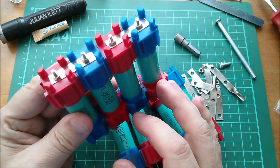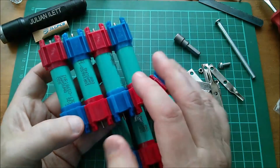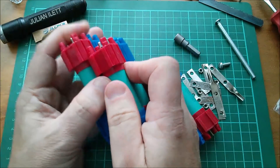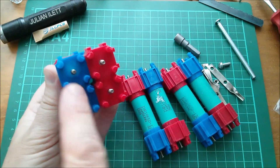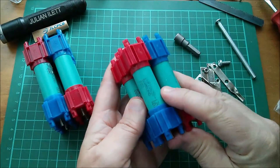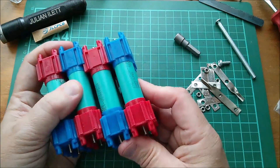So this is my 4S — four cells in series. You can see that these two are hooked up. On this side we'll need one across the middle, and then that'll be my positive and that'll be my negative. But I'm not actually going to do the four cells in series to start with. I'm going to put this module on top of this module and create a group of four. So now you can see that this is a 2S2P — parallel because these are the same color. And this is why it's important to have the dovetails opposite the slots: I can now work with these in blocks of four and slide those onto there.